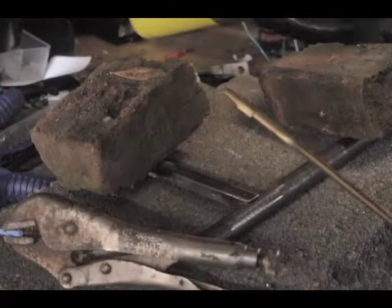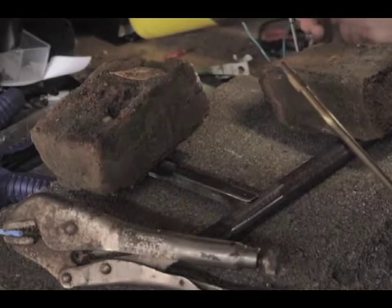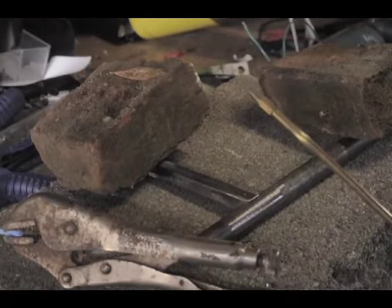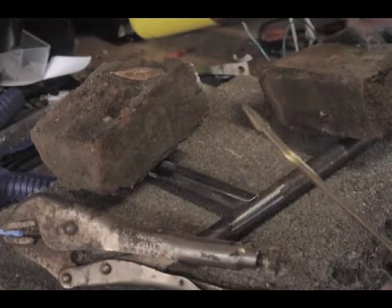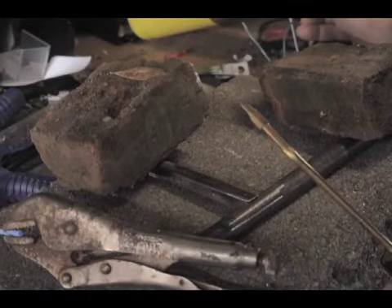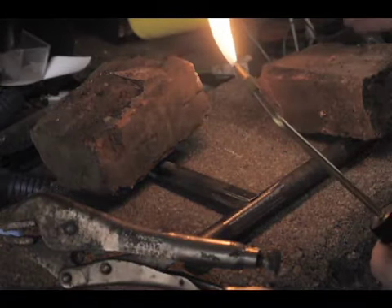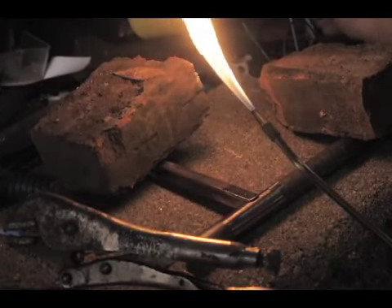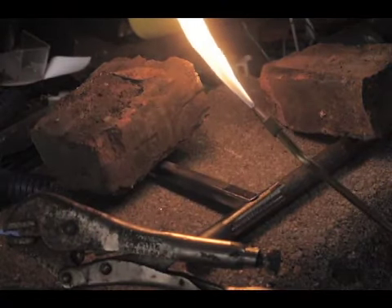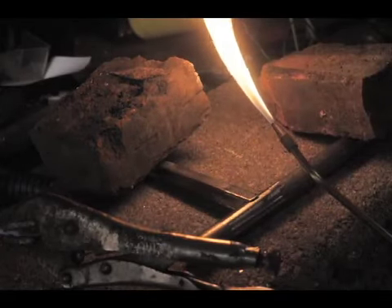Here's how you get it going. First thing to do is crack the fuel valve — which is the MAP gas valve. The one thing you want to make sure you don't do is open and light the oxygen valve without any MAP gas already burning. That's the biggest caution repeated over and over in the instructions. I'm literally just cracking the MAP gas valve. Now I've got a little bit of a flame. The instructions say to crank it out to about a 7-inch flame.